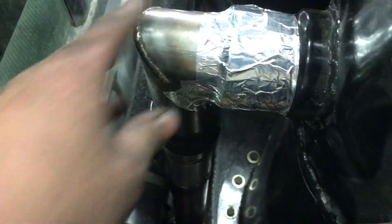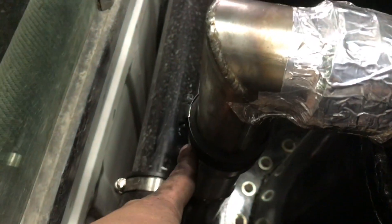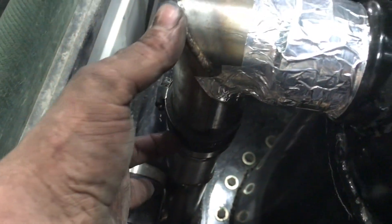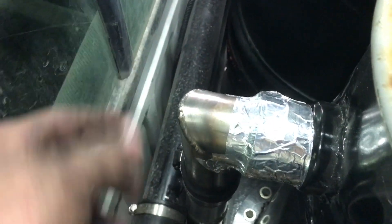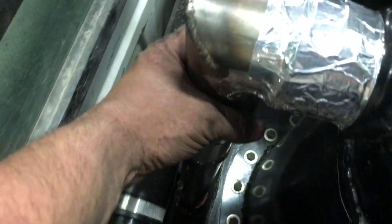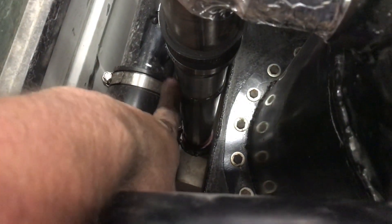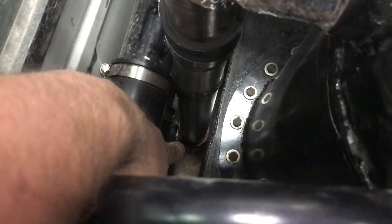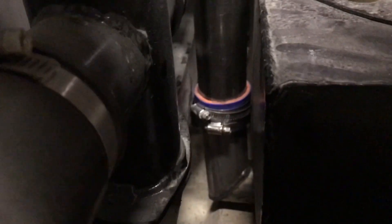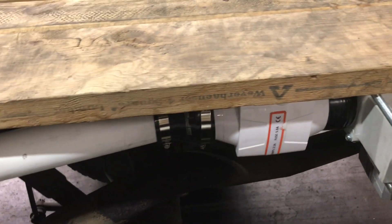Down to the last of the plumbing. There's the gas outlet pipe, sealed up with a liberal amount of HVAC aluminum tape — several layers, make sure you've got it good and stuck down all the way. Got a coupler right here. The reason there's a cut in the pipe is this dog leg that hangs down — this has to spin to go in and out, and we need some clearance. That's why that pipe is short, but it also gives me a pretty good handle to tighten the thing down when it comes in and out. Pipe going straight down in between the cooling rails, the front tank, and the gas fire. You can just see a silicone coupler down there — then she kicks underneath, still in metal pipe, comes out the front over the top of the crossmember, another silicone coupler to PVC, and over to the blower.